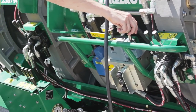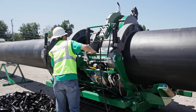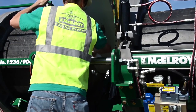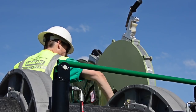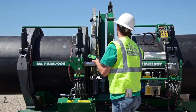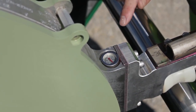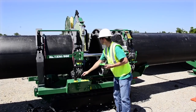Open the carriage just enough so that the heater fits between the pipe ends. Shift the indexing valve to line up the heater and then pivot it part way into the carriage using the heater pivot valve lever. Wipe down both sides of the heater with a clean, dry, lint-free, non-synthetic cloth. Use a pyrometer to check each side where the pipe will come in contact with the heater. ASTM specifies that the heater surface temperature be between 400 and 450 degrees Fahrenheit. Note: the thermometer on the heater should not be used for this purpose — it tells the internal temperature of the heater and is just an indication that the heater is hot. Pivot the heater in the rest of the way.